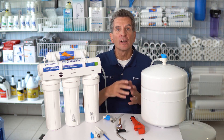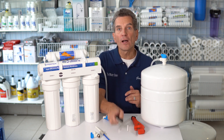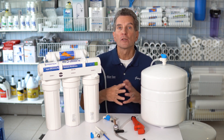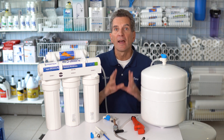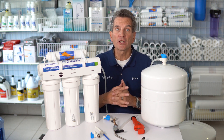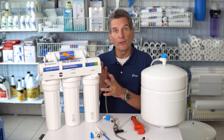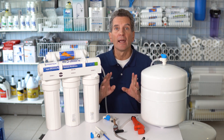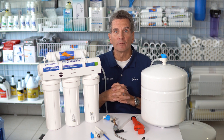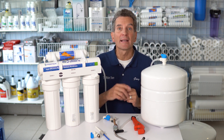The next thing you should consider is where the tank is located. The closer the tank is to the faucet, the better your flow. Generally speaking, if the tank is installed immediately underneath the kitchen sink, that will give you the best flow. In some situations that may not make sense — in my house, for example, the reverse osmosis system and the tank are both installed in the basement due to space restrictions. But to improve the flow, you can add a second tank.